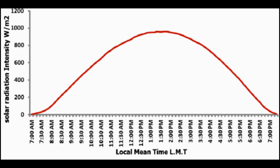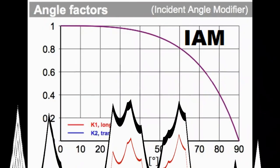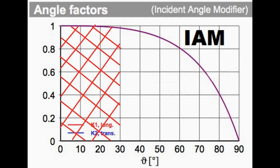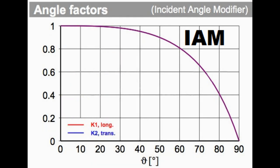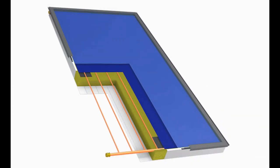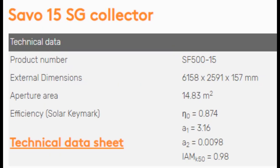The second cause is that we must multiply this solar radiation by such a coefficient commonly called the incidence angle modifier. This is the angle of incidence of sunlight on our solar collector, and this range corresponds to the middle of the day, but morning and evening have large angles of incidence within this range. A physicist can explain our coefficient by the fact that the more the sunbeams incline towards the surface of the collector, the smaller the proportion of solar radiation absorbed by the dark plate and passed through the glass. Sometimes the seller can tell us the coefficient of his solar collector, and here we see our coefficient for the angle of incidence of 50 degrees.